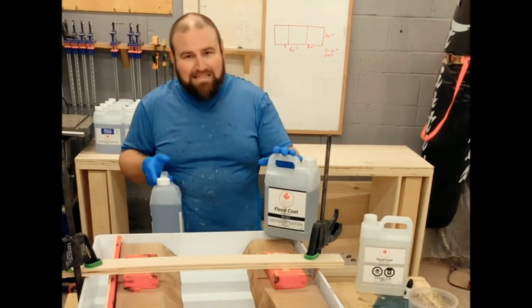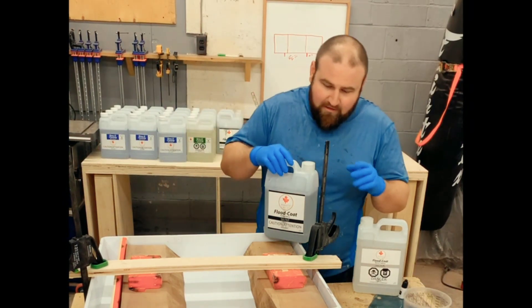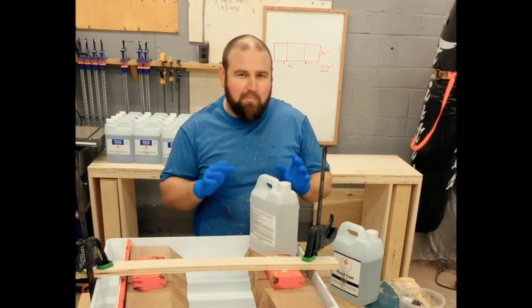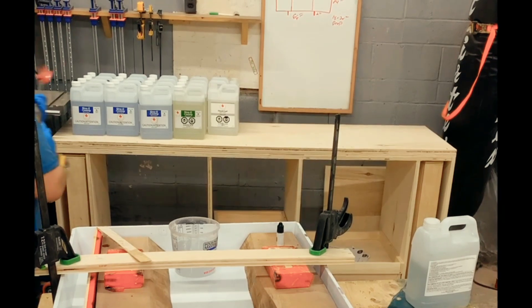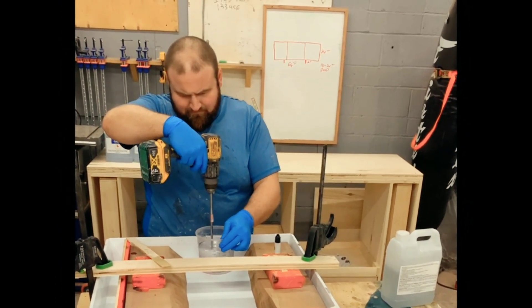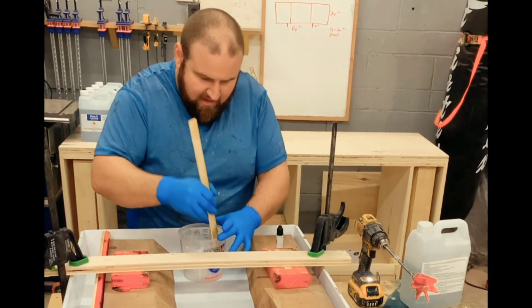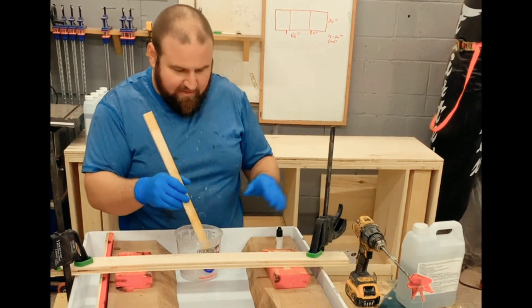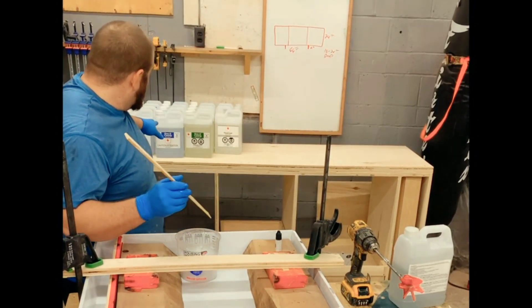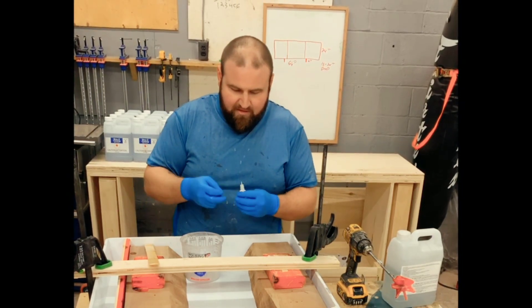Don't use a flood coat or a casting epoxy for this — do a thick pour. We're going to end up doing about 2 inches with this. The only downside is it is a 2.7 to 1 mix ratio, so you do have to do a little bit of math to get your numbers correct. I can't stress enough how well you need to mix your epoxy. Take as long as you need to make sure it's very well mixed — you can't fix unmixed epoxy. Get a stir stick out and scrape all the sides and the bottom. The only problem with mixing with a mixer is it adds a lot of bubbles, but with the Slowcast drying over 2 to 3 days, it gives enough time for all the bubbles to pop.